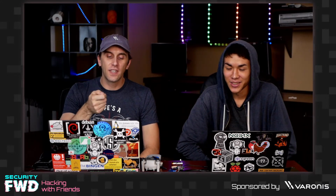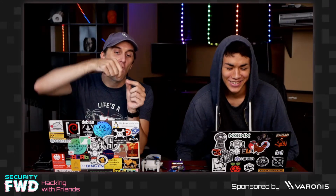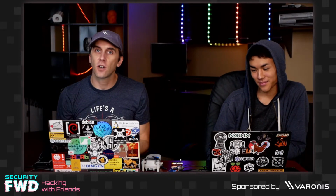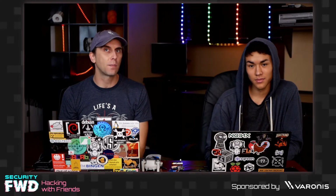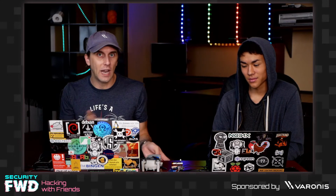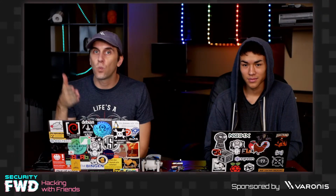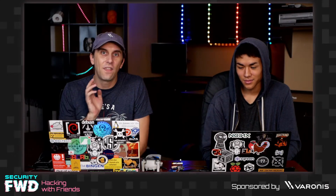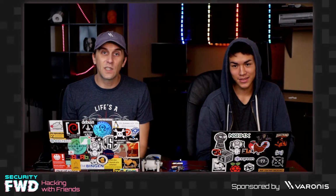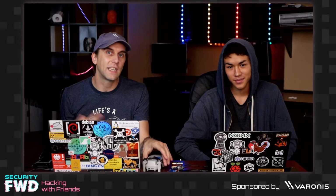Alex took this sacrificial USB cable, cut it open, then used his teeth to strip the wire, wrapped it carefully around each terminal, and soldered it into place, though our soldering iron didn't have the correct power supply. The power supply that we had could sometimes have issues above certain temperatures, but Alex managed to get it working okay. He soldered it into place, insulated the wires so that they stop shorting each other, and then got this thing flying and durable enough that we've been pulling on it, and it has been pretty abused, because there's a bunch of sensors on the bottom of this drone that cannot be obstructed in order for it to fly.